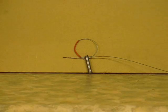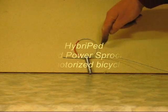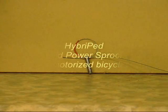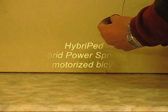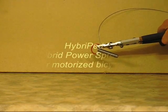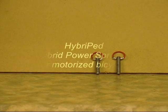We move on to the coupling pin showing the extraction ring. It is made of common bicycle brake wire which makes a loop and passes through ferrules positioned at both sides of the pin. Here the extraction loop is being swaged, and here are two completed coupling pins.